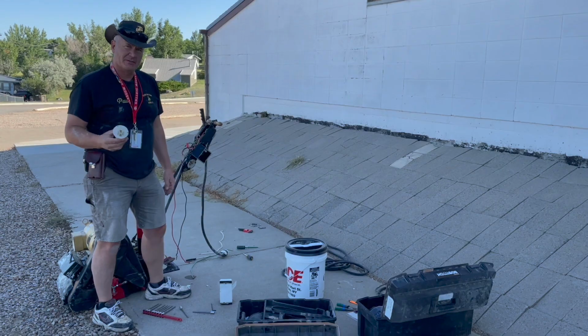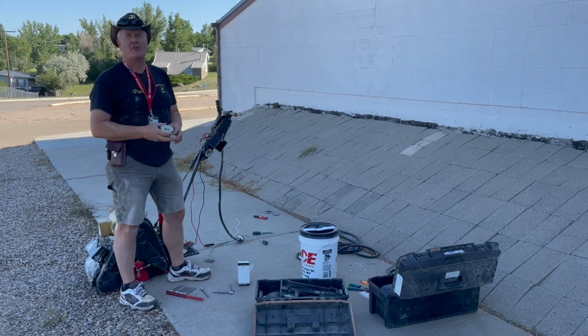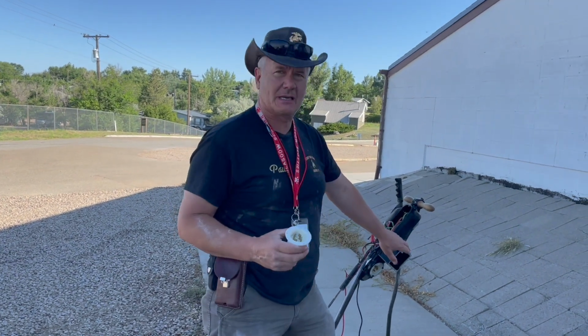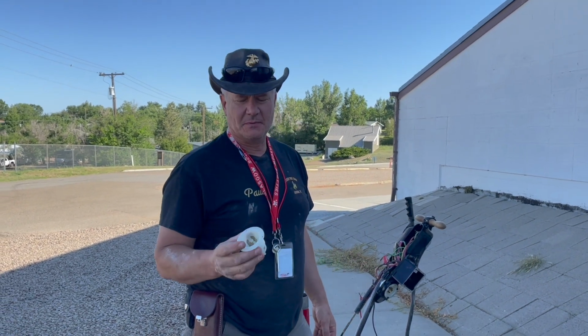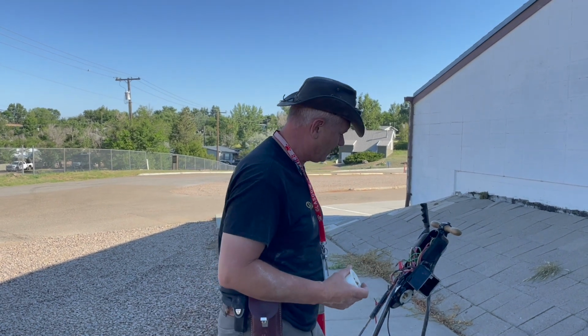I have a little electrical problem with this sander. This little cup, this little receiver on the handle itself went bad. The machine was still running, but this box was getting hot. I could tell I had a short in it. When I opened it up, that little plug was in poor shape, not making good connections, so I'd tear the whole thing apart.